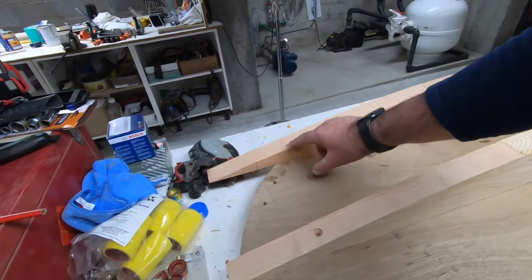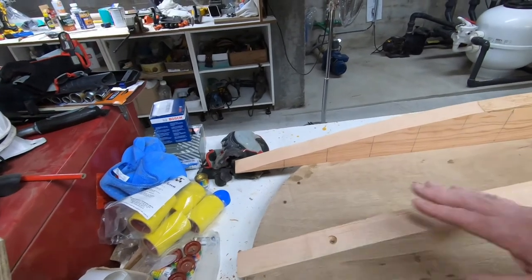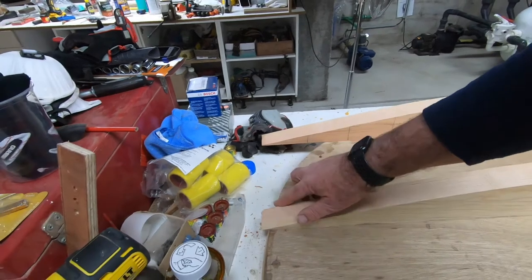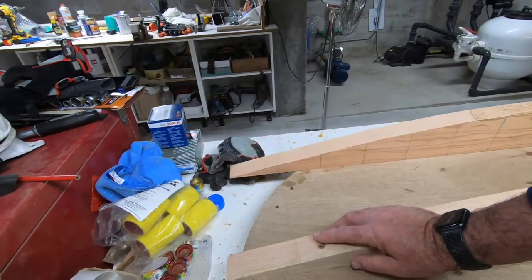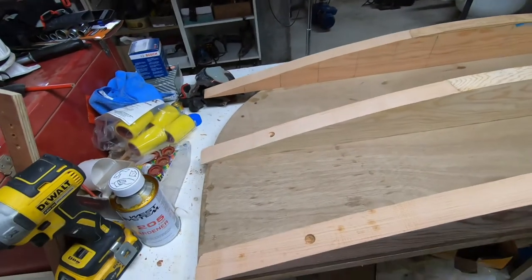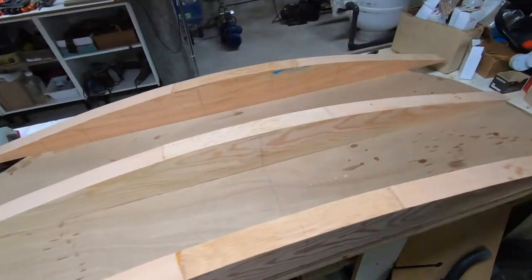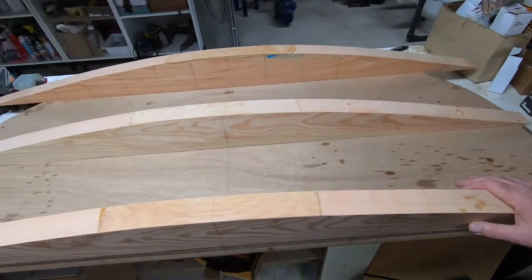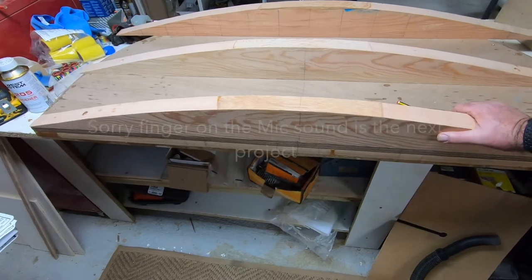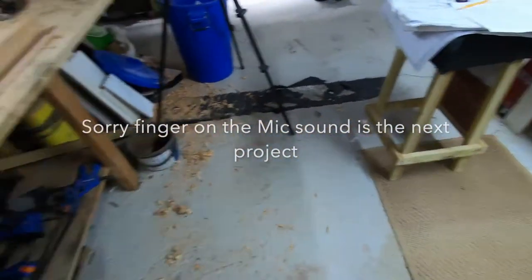There will be two pieces here and two more across the top. The problem is this angle is at 12 degrees — I've got to cut that in because eventually the side plywood from the boat will lap onto this. This will form the barrel back transom, so I've got to figure out how to cut that at 12 degrees and also make these fillets out of this wood. It's going to be rounded and smooth to this and at 12 degrees to that. You look at the finished boats and see these fillets and just don't realize the amount of work that's gone into them.